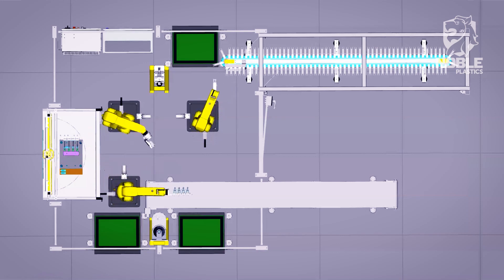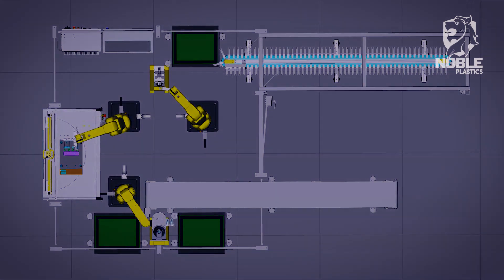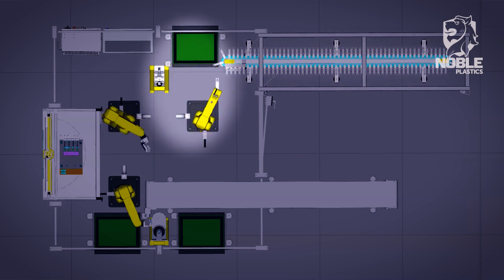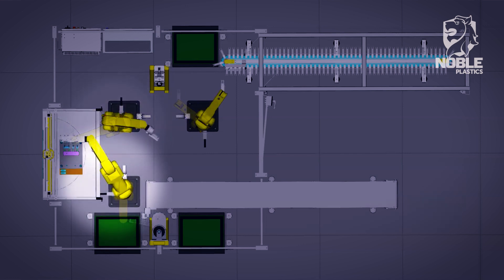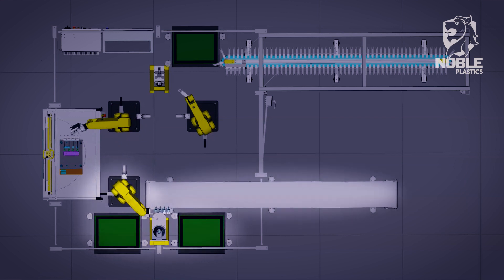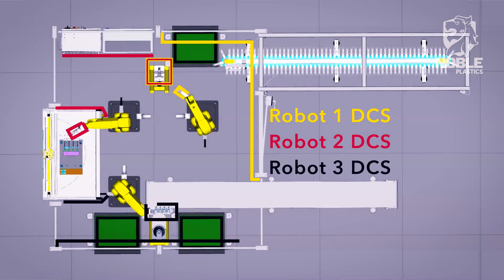The automation process consists of six major steps illustrated by this RoboGuide simulation. The steps are: management and introduction of operator-loaded substrates; incoming substrate inspection and preparation; loading of substrates into the mold; unloading of molded product from the mold; final product inspection; and dispensing of product from the cell. The cell is designed to be tended by a single operator and conforms to a small footprint to conserve production space.